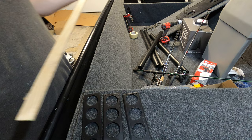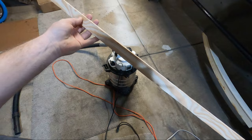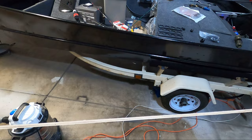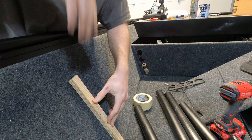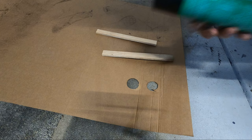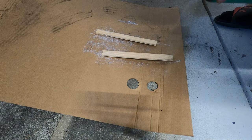While giving that more time to dry I'm going to work on that vertical mount. I've been holding on to this piece of wood and I think I'm going to use it to make that vertical mount. I'm going to cut two pieces off this run, sandwich them together, then wrap it in carpet — that's going to be my mount that the clips clamp onto. It should mount right out there and fit perfectly right against the wall. I'm going to use this high-strength contact adhesive rather than wait for epoxy to dry, and then go ahead and join these together.